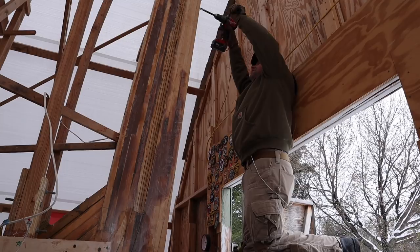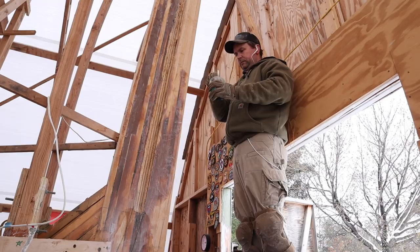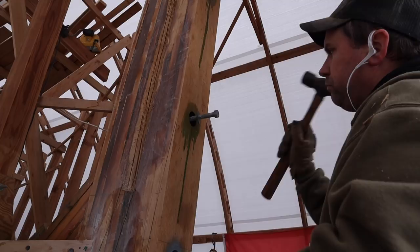And I only installed three now because when we put our keel shoe on, that's obviously going to bend up around the stem, and I'm still contemplating if I want to through bolt that keel shoe on through the stem entirety. So we have to decide that later on down the road, but at least we have three in for now to start our planking process.